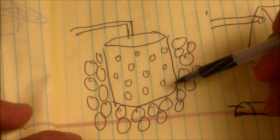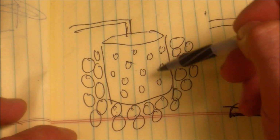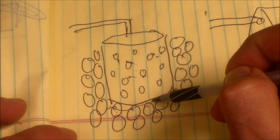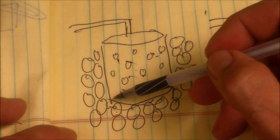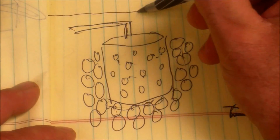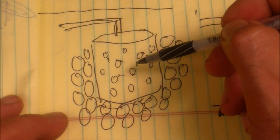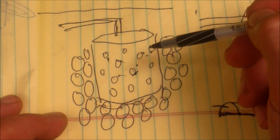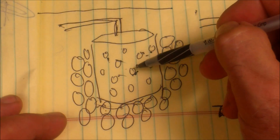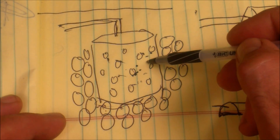The most common type of gray water system for a backwoods cabin is nothing more than a barrel put in the ground. The barrel will be full of holes. It helps if there's no bottom on the barrel. It's surrounded with stones, and the gray water is dropped into it. All of this is put below grade. If you have good drainage soil and you're not dumping a whole lot of greasy water into it, and it's only used occasionally, this type of system will work for quite a while.